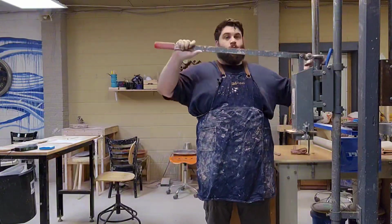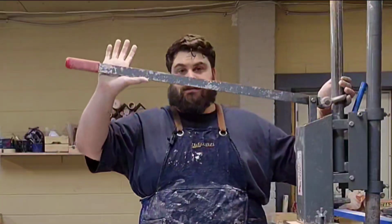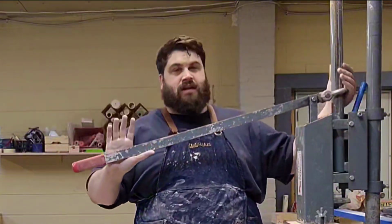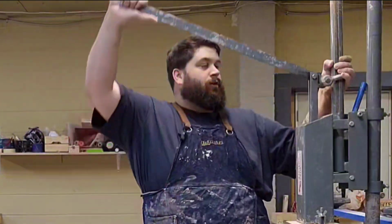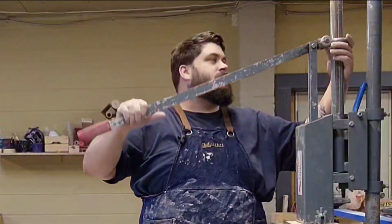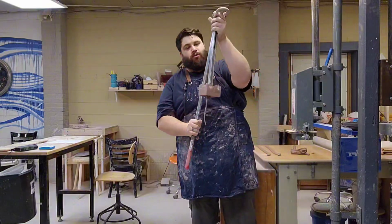Basically, I'm going to walk the plunger back up. If you're struggling to get it to come up, you notice how I'm trying and nothing's really happening. You could take your hand and stop this D-ring in the back, and it will come right on up. And then just take your time and walk it. Be careful not to pinch yourself doing this. And then once you get pretty far up, you can then just finish by pushing it out.